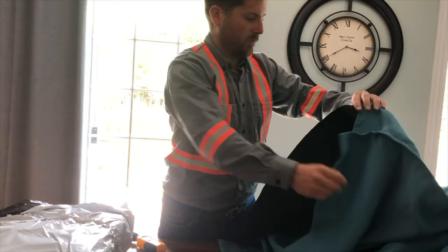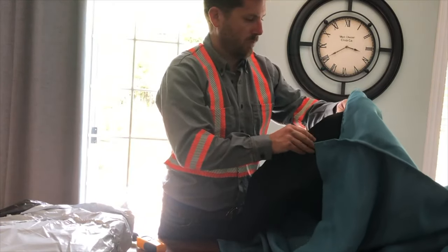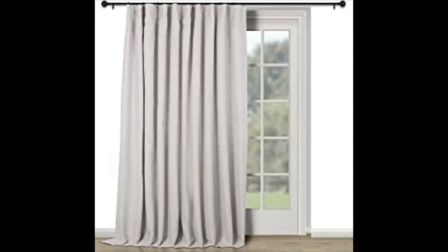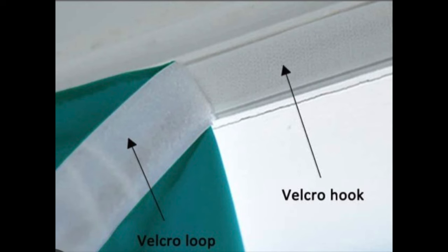The next thing is sound deadening curtains. It's not going to stop a lot of noise coming from outside, but it's going to deaden a little bit of the noise coming in from road noise and traffic. There are certain ways to install the curtain that will reduce a lot more noise. Instead of buying two panels with a slice in the middle bleeding in noise, just buy one big curtain. You can also add velcro all around your window frame and on the curtain to create a seal — that will reduce a lot more noise coming in.